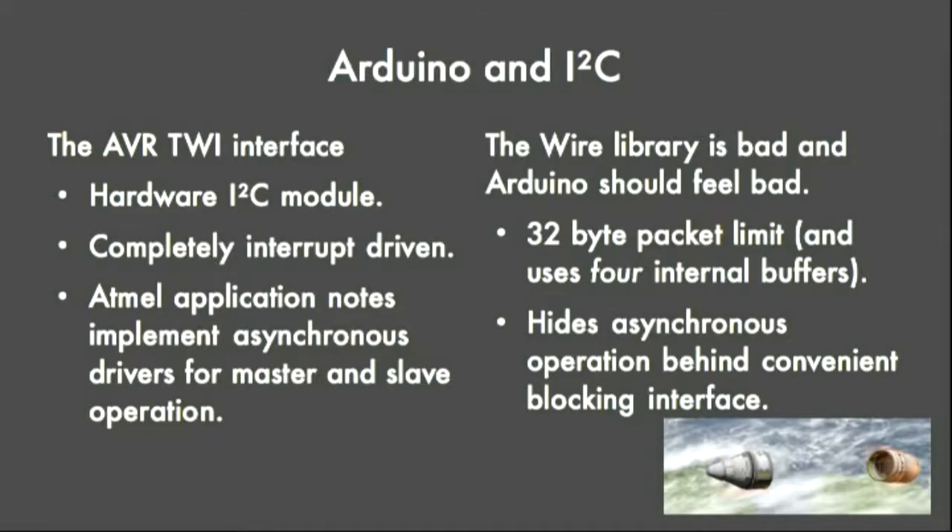While I was waiting for those boards, I started worrying about how I was going to talk to them. I chose I2C for a couple of reasons - mostly because I have one master sending data to multiple slaves and I wanted it all happening at the same time. I2C has a broadcast mode: if you fire packets off to address zero, in theory everything will pick it up. In practice, the library I'm using on the TNC doesn't support that yet, so that was really bad.